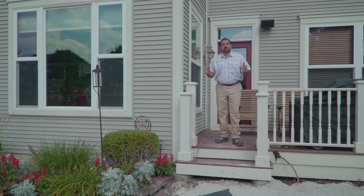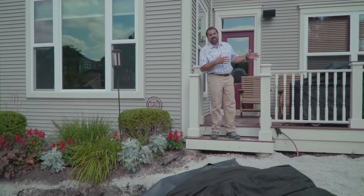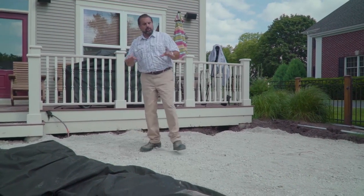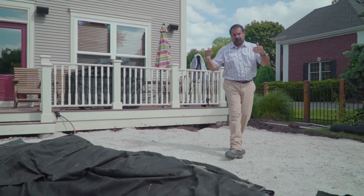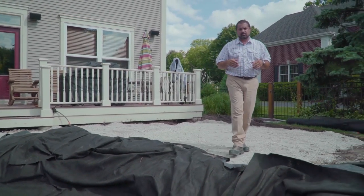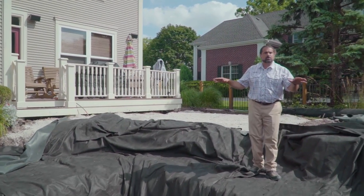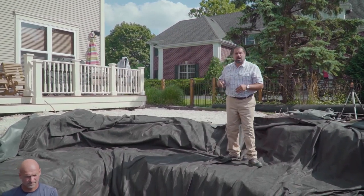Decks aren't permeable. Just because you can't see where the water's going doesn't mean you're managing it. This homeowner's stuck with this small deck area — they don't like it because it's so enclosed, so we're going to build them an upper patio. This upper patio will pick up on that theme. We're going to use our Borealis Plankstone wood-textured slab system in an interlocking system. We're going to eventually spill over a Prescott set of steps to a segmental permeable pavement system using Aquascape's rain harvesting technology. We're going to use our Victorian permeable in chestnut brown for the majority of the area, with a small mosaic picking up on that Borealis theme of the upper landing.